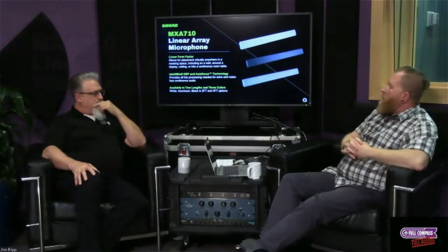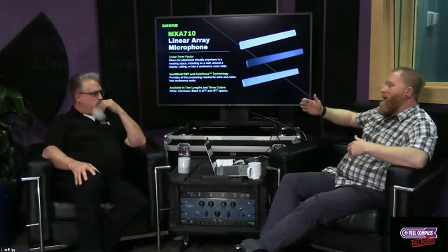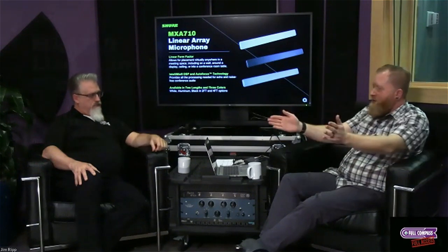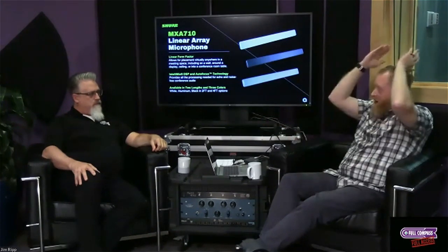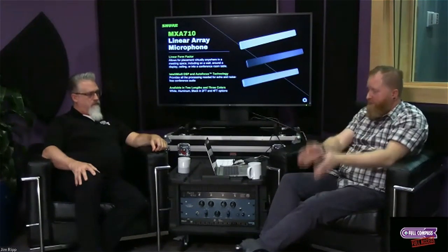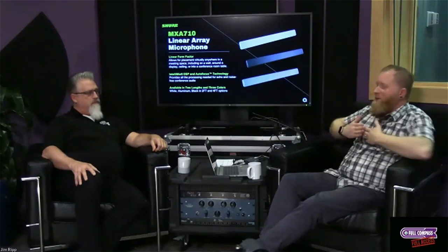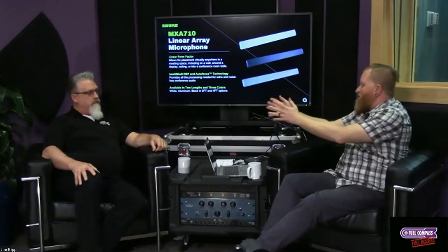That's a very good question. On your patterns, if you are in a horizontal orientation, your patterns are steering left to right. But because it's toroidal, it's going to pick up floor to ceiling. And then I can aim it over at you. So if I had, on the microphone here, I can aim a lobe at you or your position to be able to pick you up.